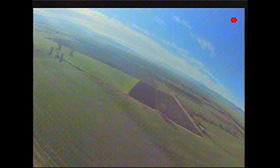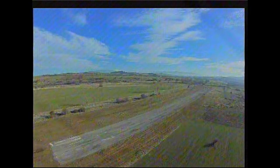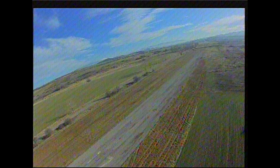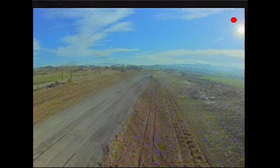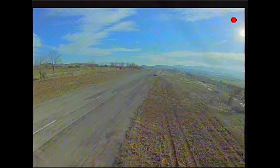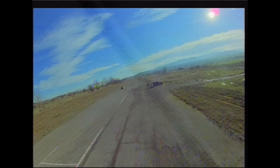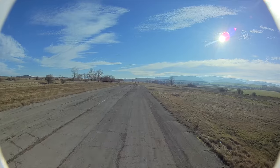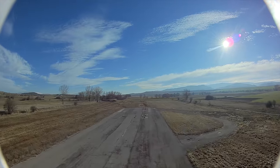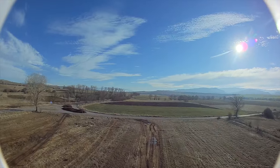During my flights, I was getting some black lines in the goggles, but they're most likely coming from the RunCam Split, because all of the video gear is directly connected to the flight pack without any filtering. I'm pretty certain it is not the AKK VTX, as their products have been pretty solid so far. But the Split has been known to be sensitive to dirty power. An LC filter would do wonders to clean up the image I'm seeing on the ground.